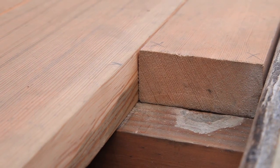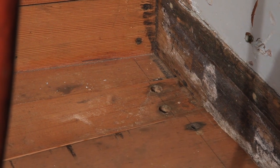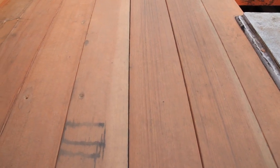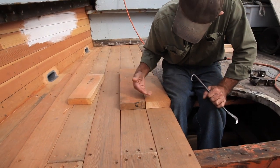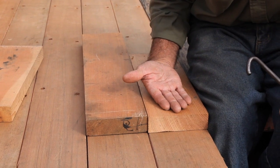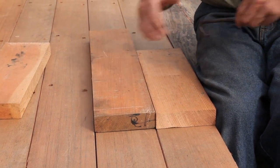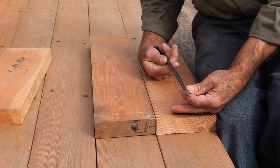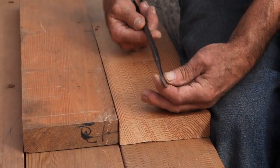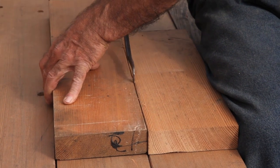You can see that we've laid the deck into position here — the decking on top of the deck timbers — on a temporary basis. There are a few things we need to do yet, including opening up some of the butt seams to get caulking in and repositioning some of them. It's made out of a two by six, which ends up an inch and a half thick by five and a half inches in quartered or edge grain Douglas fir. We placed it square edge and crowded it up as tight as we could, then I took a reefing hook — designed for removing cotton caulking — to adjust the size of the seams.